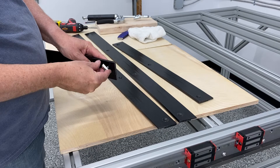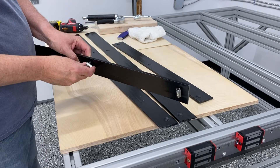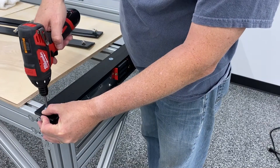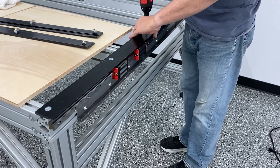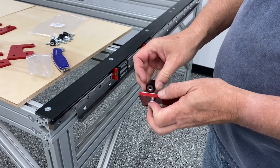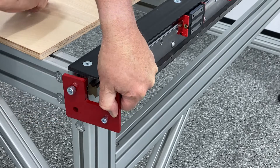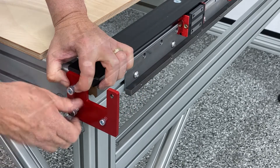After you get your linear bearing blocks on, go ahead and secure the plastic dust covers with the T-nuts and screws. There are two dust covers per side — a short one and a long one — and they just meet up on the top portion of the extrusion. Then you're going to put the bumper plates on; there are four of them, two in the front and two in the back. They serve two purposes: one is to provide a mechanical stop for the Y-axis, Y-plus and Y-minus.